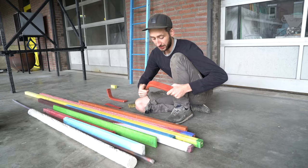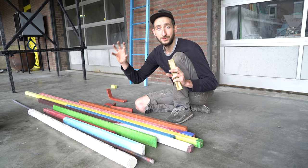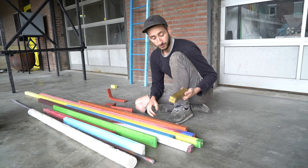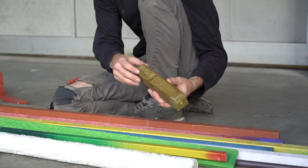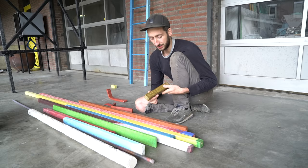The material we mostly work with is polyethylene and polypropylene, because the material has quite some shrinkage — so once it's in the tube and it cools down it shrinks, so you can easily take it out. We also did some tests with polystyrene which is nice — it's super hard, it almost doesn't bend and you can really finish it. However this material shrinks less, so it can be a bit more difficult to get out of the tube.